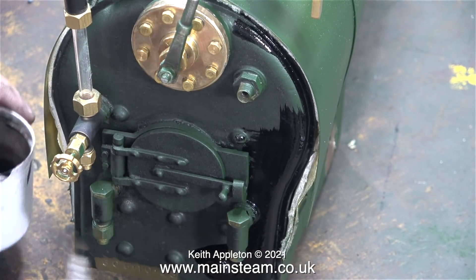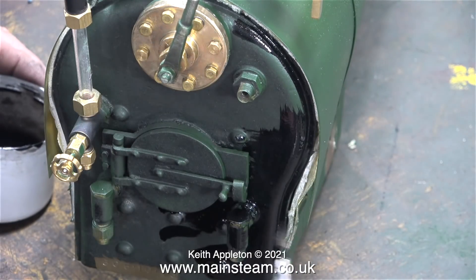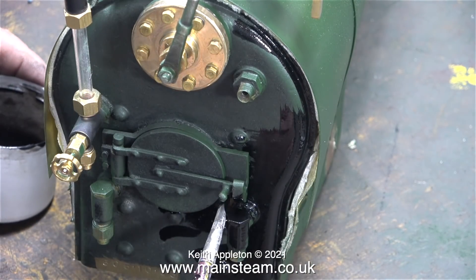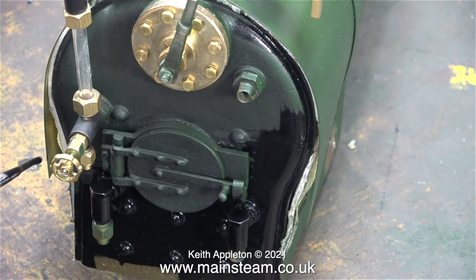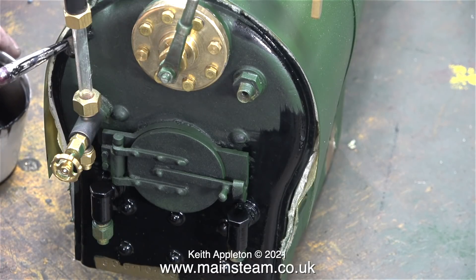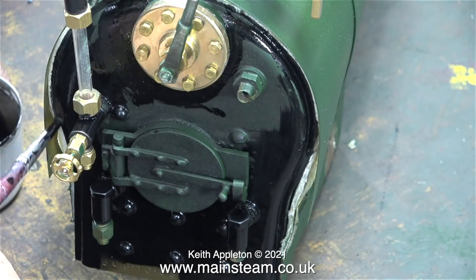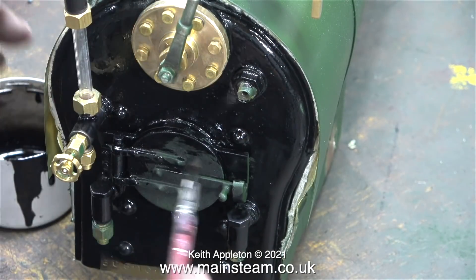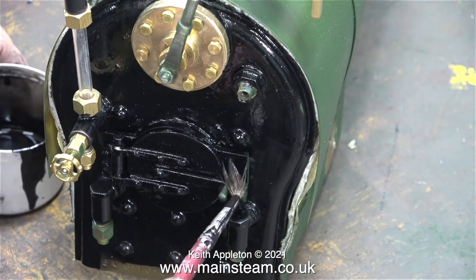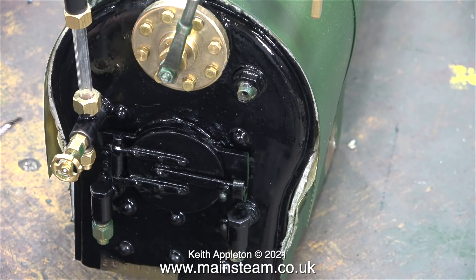So it's back into the inside of the workshop to repaint the boiler back head. The overspray, as you can see, has really gone everywhere — note to self, try and make a better job of masking in future. In actual fact I was going to give the back head another coat of paint anyway, so nothing's been wasted. I also need to carefully paint around the edge of the boiler wrapper to cover the heat insulation material, trying really hard not to touch any other parts with the brush, though the odd spot is inevitable and will be removed when the paint's dry.